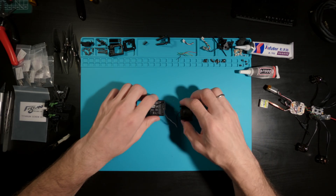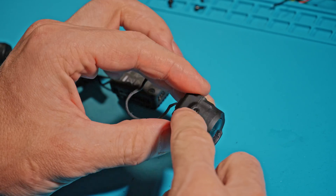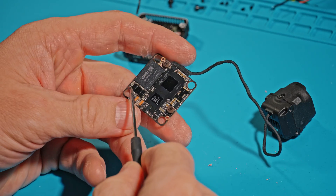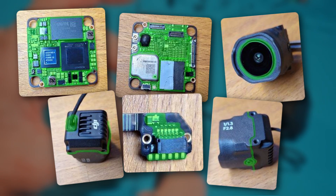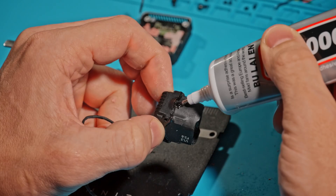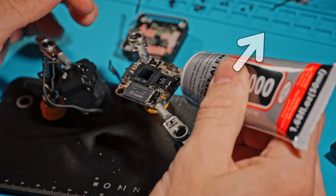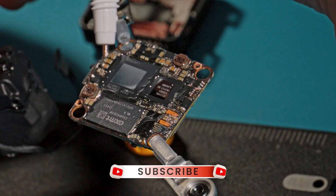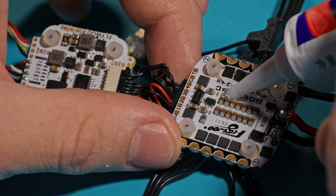After covering one side of our stack, we set it aside to dry for a couple of hours, and in the meantime we'll work on the O4 unit. We need to apply glue to the joint between the two parts of the camera body and around the lens, as well as to the unit board and the contacts for connecting to the flight controller. To understand what needs to be covered, take a look at the schemes created by STOCK FPV — I will leave a link in the description. All details are in a special waterproofing video on my channel. Subscribe if you haven't already. Leave the O4 unit to dry, then cover the other side of the stack.